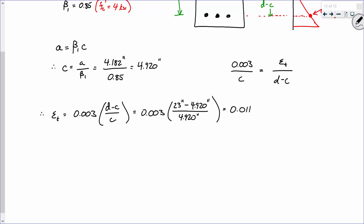Now it's in the slide so you can follow along, but how do we do that? How do we compute how much strain causes yielding? Well, we take the yield stress. Put it over the Young's modulus. So what is the yield stress? There we go, exactly, because it's grade 60 rebar. Now what's E? Remember I told you I'd burn this number into your head before you got out of here? There we go. All right, so what do we got when we plug and chug this out? It's like 207. No, we'll drag it out a little bit.